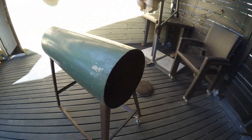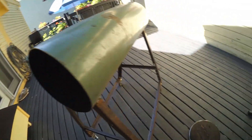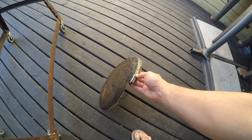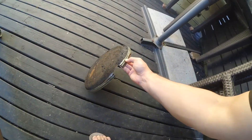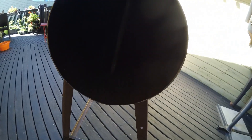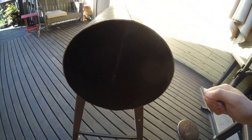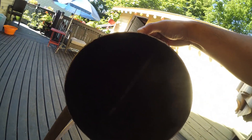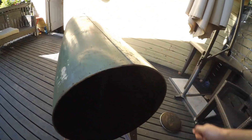After about 15 minutes of grinding and two cutting discs, I'm through the tank. This is what probably 20 or 30 years of rust and water sitting in there looks like — it looks pretty bad in there, I won't bother to show that. But structurally the steel is still quite good. It looks like it's about maybe an eighth of an inch thick, which is pretty good. Hasn't rusted through anywhere, so it's nice and solid.